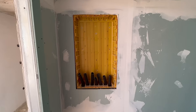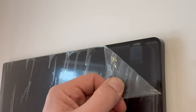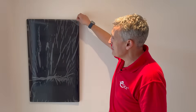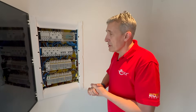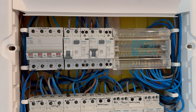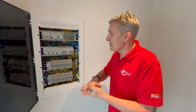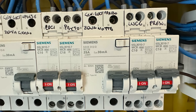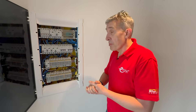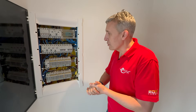We also saw the first fixed stage of this consumer unit. Let's take a look inside and remove the cover to find out what's going on. Most of the circuits here seem to be on their own RCBOs, and because this is a TT supply they're all double pole devices. We've got a few MCBs here sharing a common RCD — what we'd call a split load arrangement — but remember that's spread across three phases, so not too many circuits relying on one device.